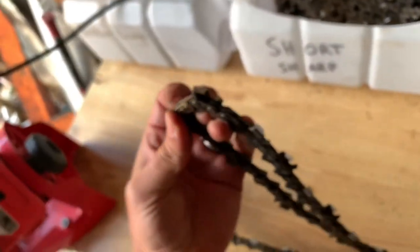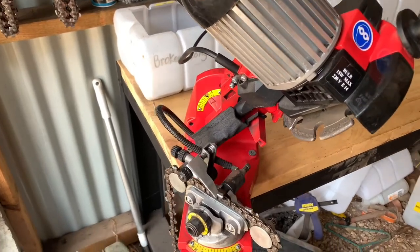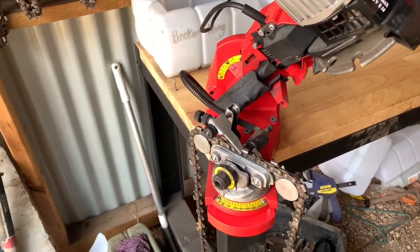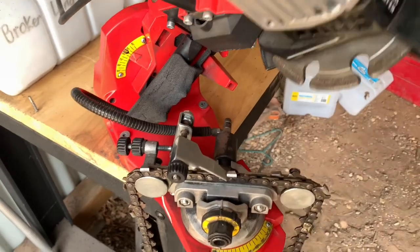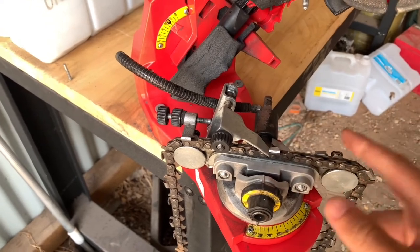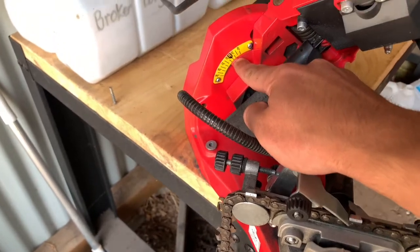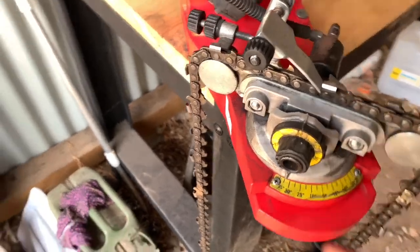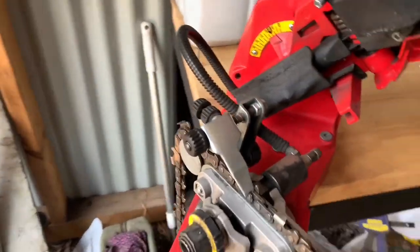Now that's all joined there with the new joining link and plate. Now we can get on to sharpening it. The grinder that I use is a Tecomec Super Jolly — it's around $550 but definitely worth its value. It's got a nice hydraulic piston in here that presses against the chain every stroke that you pull down, which holds the chain in place so that you're getting bang-on angles. I run the cutting angle at 50 degrees, the top plate angle at 35, and the guide angle at 10. Let's sharpen this one up and it will be good to go.